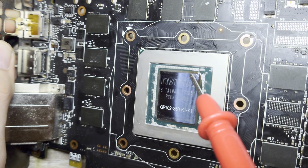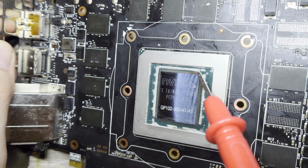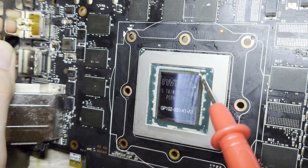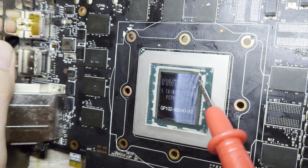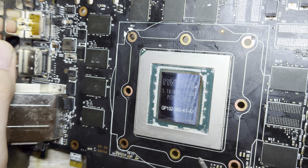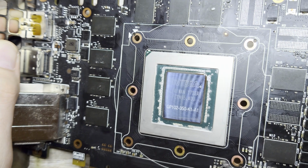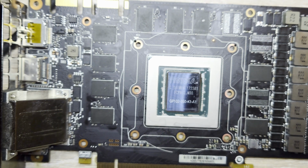Now, when the compound or glue or resin browns, it's usually due to the improper use of a heat gun. But in this case, I think this is actually naturally occurring. I think what's happened is likely the memory controller itself at the outer edge of the die has unfortunately become faulty, maybe shorted a little at some tiny, 16 nanometer transistor, and that this particular card actually has a faulty memory controller and not faulty memory. But in either case, let's just try to take one more piece of evidence.